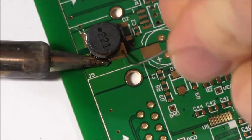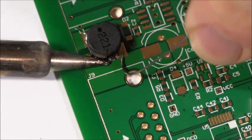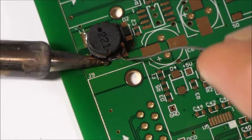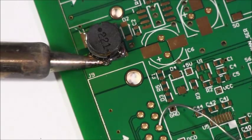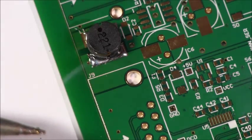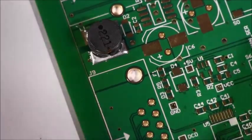We're sitting here patiently waiting — it's probably about 30 seconds before we're going to start to actually see that solder melt on this side. And there we go, now we're starting to melt on this side, so we know we've heated the whole pad. We can dab on a bunch of solder — we're heating on both sides and that should be good. It's definitely flowed around, which means it's definitely flowed underneath. Take this away and give it a few seconds — you can see it go from the shiny look to the slightly more cloudy look.